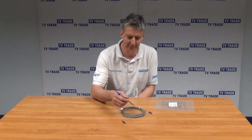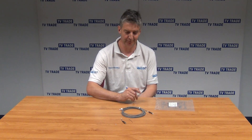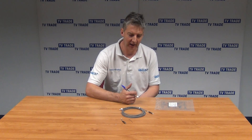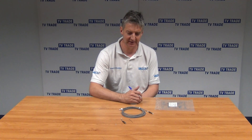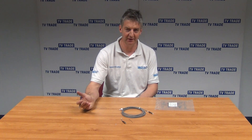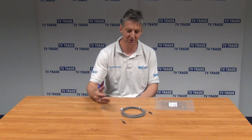The diameter of the cable itself is three millimeters and it has steel armor inside the center of the cable, which gives it such great strength. It is LSZH, which means low smoke zero halogen — it's non-halogenated and flame retardant, so if there's a fire it won't give off smoke.